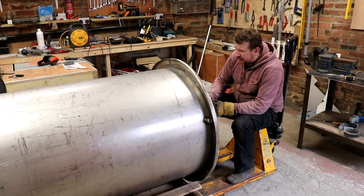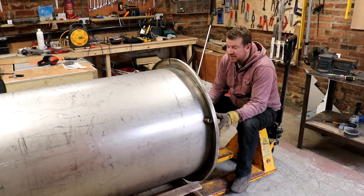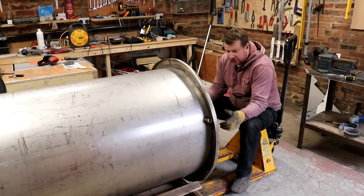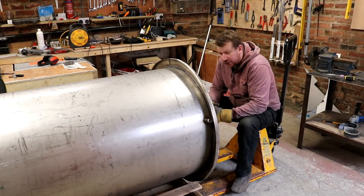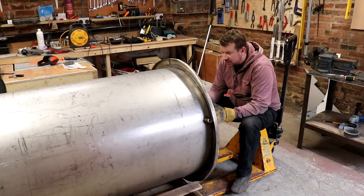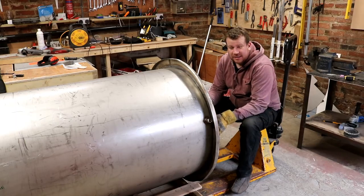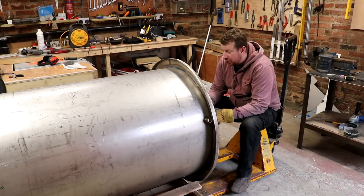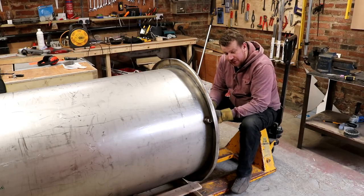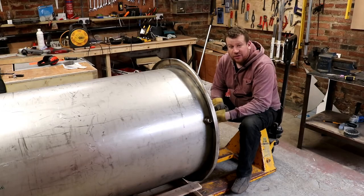Right, I've got the HLT in, and what we're going to do is finalise everything. We've got a lid cup for it — not a perfect fit, it can be changed in the future, but it'll do for the HLT at least. These fittings I'm going to go on the inside with the TIG torch, just finish off any flowing, gaps, cracks or anything like that, so it's nice and smooth and hygienic on the inside. Then I'll go back in with the sanding disc and the scotch bright pad, pull everything back to nice shiny steel, finish the top rim, and that's going to go to one side ready for pickling paste application.